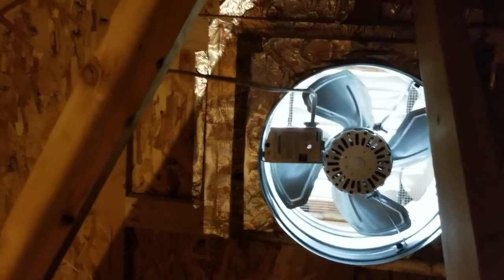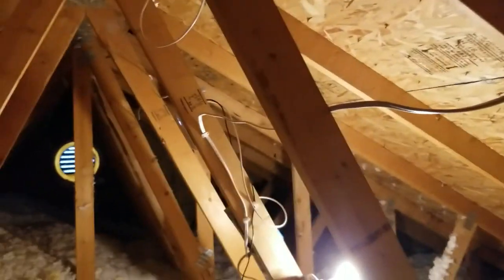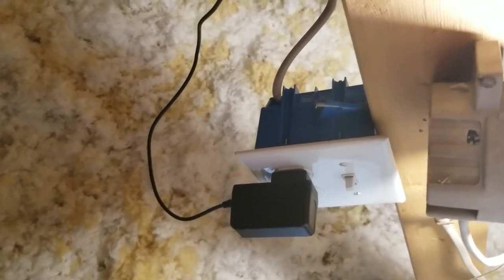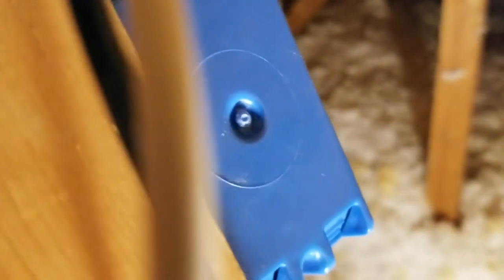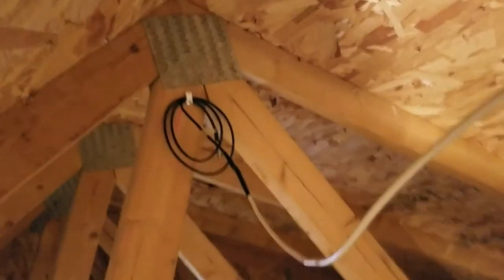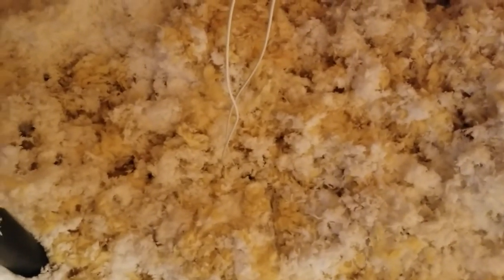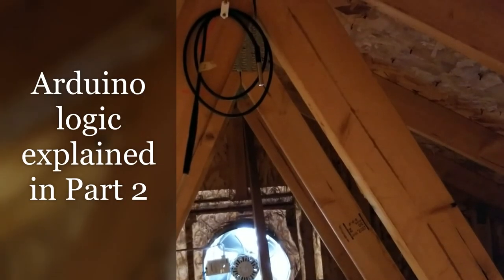Here is the fan completely installed. As you can see I went pretty crazy with the tape around the edges — I want to maximize the flow going out. Over here if we follow the power line, we go to the relay. Here is the relay box which is connected to this power box. I stole the power from this light right here and put it on a switch. This power supply is for the Arduino — this will turn the entire system off. This cable here in the relay box is the digital output from the Arduino, which is enclosed in this outlet box. Up here we have our attic temperature sensor in the air. Out the front of the house we have the outside temperature sensor, and these wires coming down into the wall are for the interior temperature and for the Nextion display. The Arduino will compare the outside temperature to the attic temperature to determine when it's smart to turn the attic fan on.